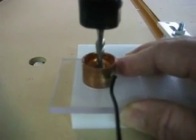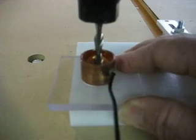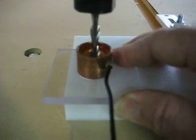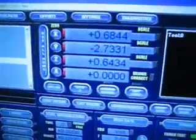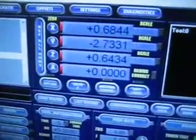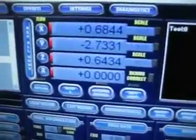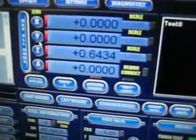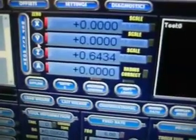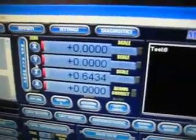It goes back to the other side — now it's touched off four points on the pipe. It knows where the center of the pipe is and moves your gantry exactly to that position. The Mach screen readouts now show the current coordinates for where the center of that position is underneath your crosshair. If you want to center your workpiece at that location, you just click zero X and zero Y, and that'll set up your machine zeroed on that spot you found on your workpiece.